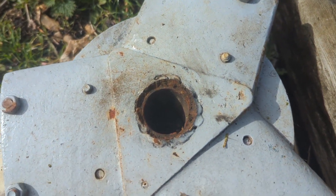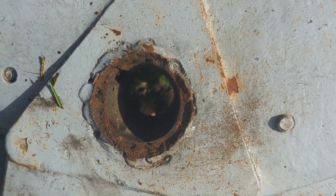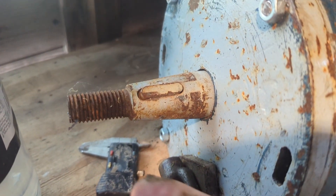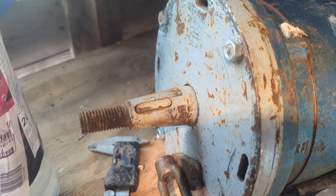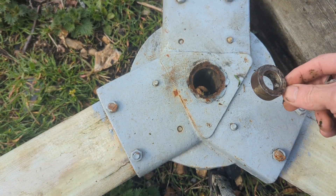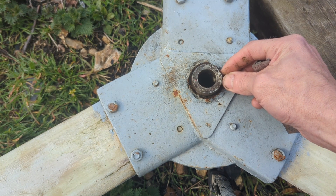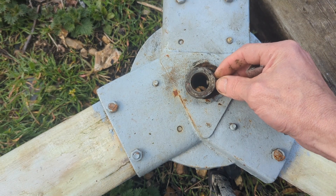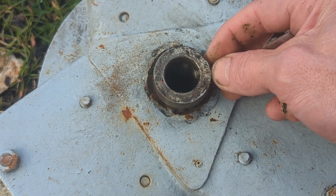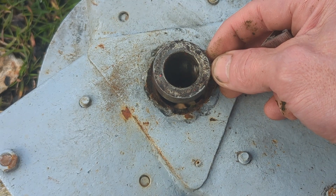Right, let me just get a pokey thing a sec. I don't know if you can see — there's a conical shape inside with a keyway, and that fits over the front of the Chinese turbine which got butchered. So when I say it's cone shaped, that's what I mean. So what needs to happen is another correct size collar needs fixing on there. Obviously if it's slightly off one way or the other that'll cause a big problem, so I need to fix this on here somehow.